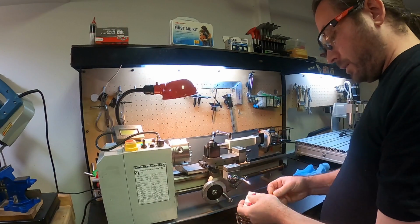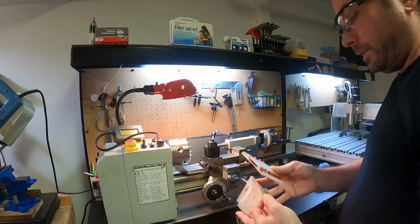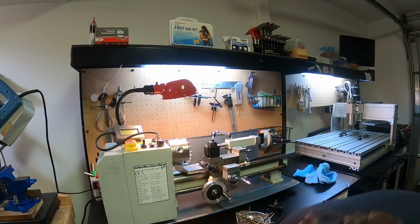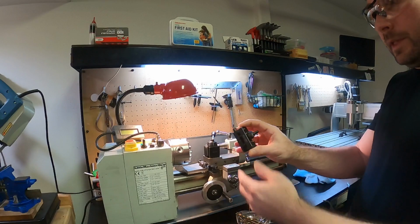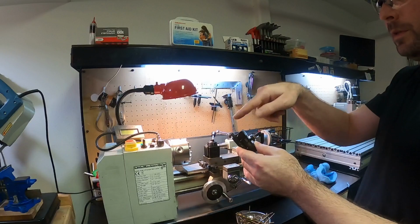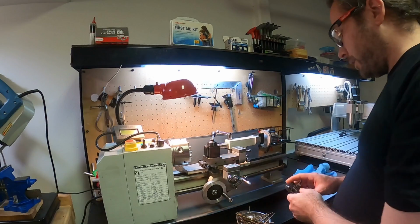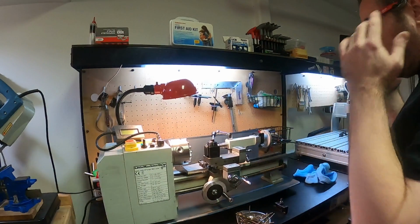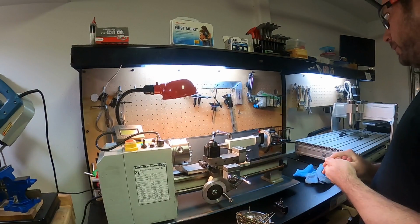So when these wear, you either have to regrind them or get new ones. Now, like I said, these are very cheap, but I don't actually like to use those. These cut really, really nicely, and when you get a fresh insert, it's got 3 points to it, so you can rotate it after one of the points dulls and have a fresh point, and go through that 3 total times with 2 rotations, and then you would get a new insert.